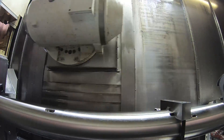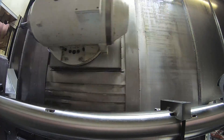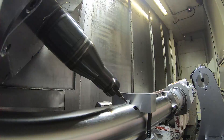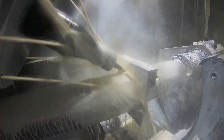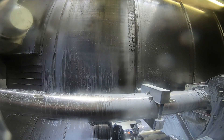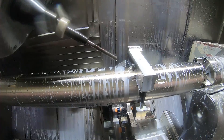Here's the machining operation to machine the hole through the drill guide and then to drill the hole all the way through the part. After I do this one initial hole through the drill guide I don't need to do it again - I'll just need to run the gun drill on the subsequent parts, just clamp the guide on and run the drill. Here's milling the counter bore with a quarter inch end mill for the start drill so that I have a good location to guide the start drill. I want this hole to be on location real nice, so I drill a start hole for the gun drill.